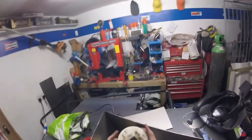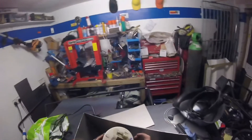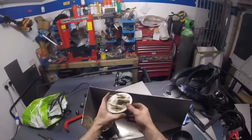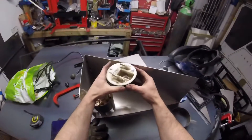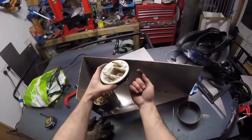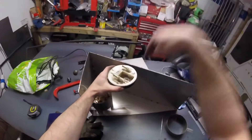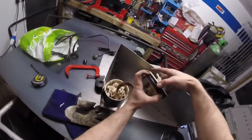I'm going to get some more stainless steel and cut a circle with a flange so I can bolt it. I've got a rubber seal here — we can cut a circle in the top piece and it'll sit in there with holes. I've got some nuts and bolts — I can weld the nut on the inside, and then when we screw the outer plate down, it will make a seal and stop the fuel coming out. Simple as that.